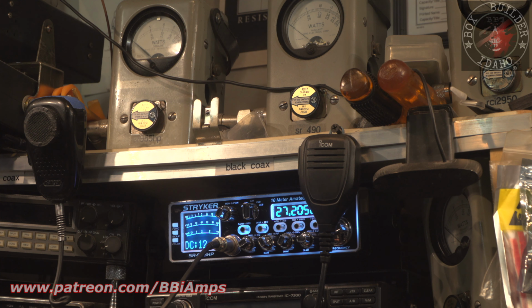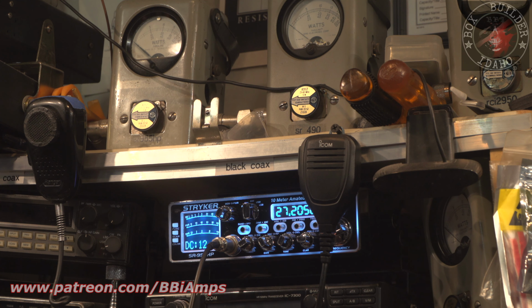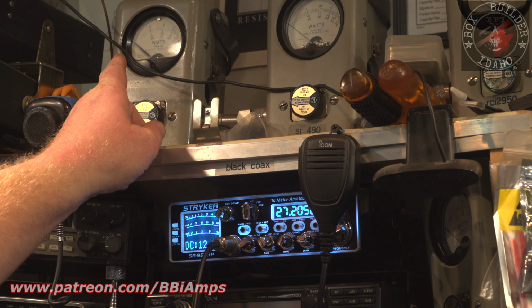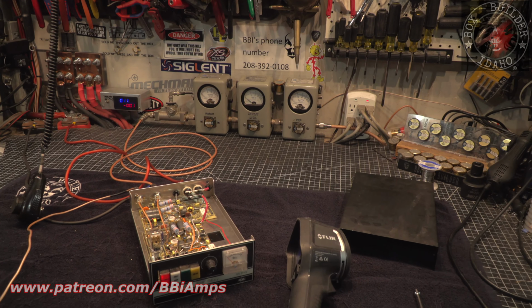Hello. So 80 going in and 3.5 watts coming back. And this thing shows me a 2. This bridge right here. Please note, earlier this last week, I was building those beautiful 4-pill amplifiers, and I spent 45 minutes trying to figure out how I can have 0 reflect here, but according to this meter, I had a 3 SWR. That's how I feel about that meter. Really. Kiss my ass. But we got it figured out. It wanted more inductor for some reason. Even though this needle wasn't moving at all underneath full modulation input, it is what it is. Okay, so it is working in theory.